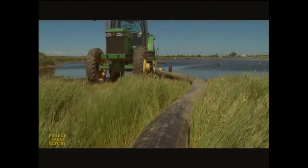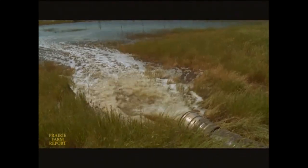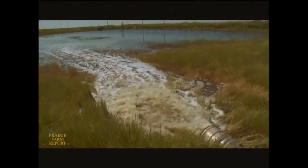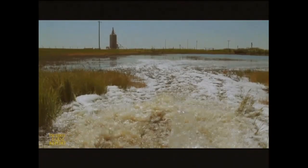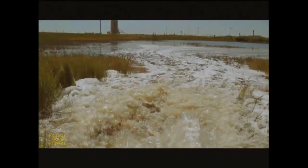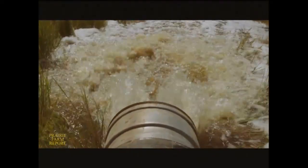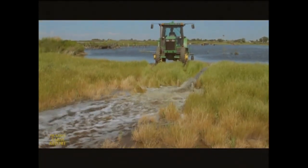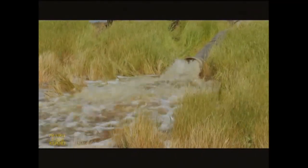The Dynaflow unit is designed to run off a 1,000 RPM power takeoff and only requires about 20 horsepower. Right now they're working with a single 50-foot hose, but Rosendahl says they have successfully pumped up to 1,500 feet with this system. They put a 12-inch hose off the discharge and once 50 feet away from the pump, reduce it down to 10-inch aluminum pipe. The gallonage drops with a 10-inch pipe but they're probably still in the 2,000 to 2,200 gallon range, providing there's not a lot of elevation in that 1,500 feet.